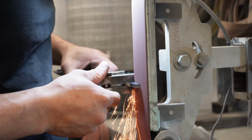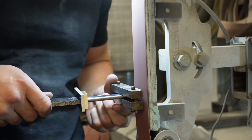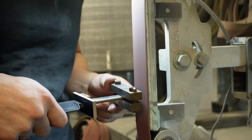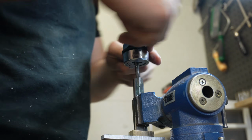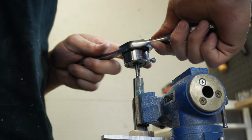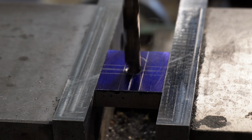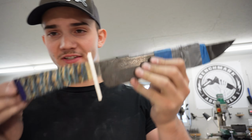The reason that I make the pommel nut before I even shape the rod at the end of the tang or make the pommel is because the pommel nut dictates the dimensions of all of those things. Generally speaking, I want about 3/4 of an inch of solid threading on the rod at the end of the tang to grab onto, so I make the end of the tang accordingly with plenty of room to get all the threading that I need. So now I am drilling the 2-step hole in the pommel using the measurements from the pommel nut that I previously made.